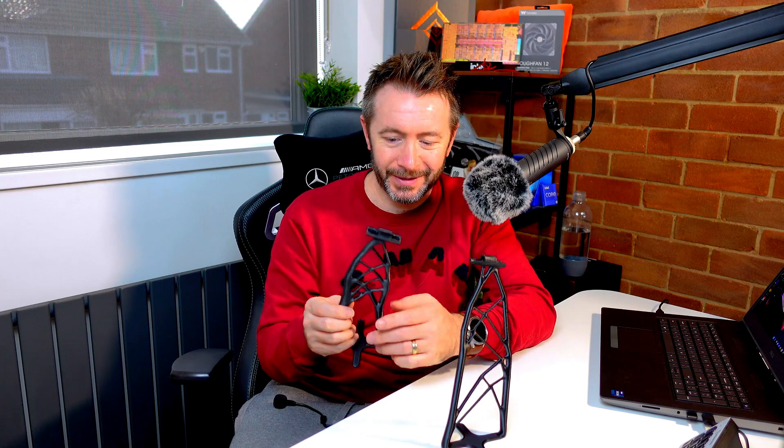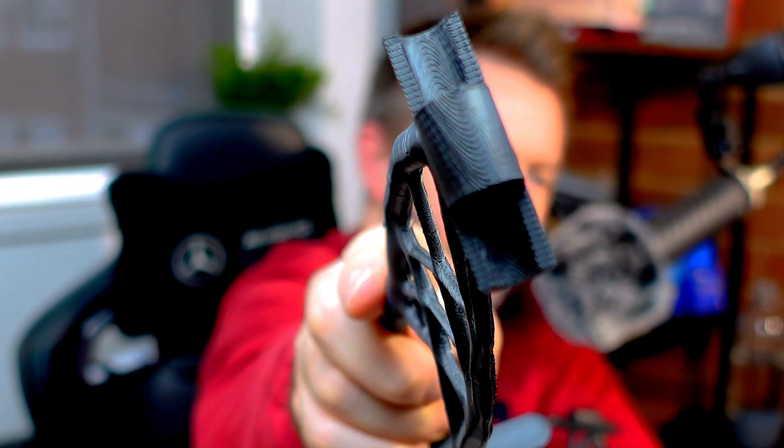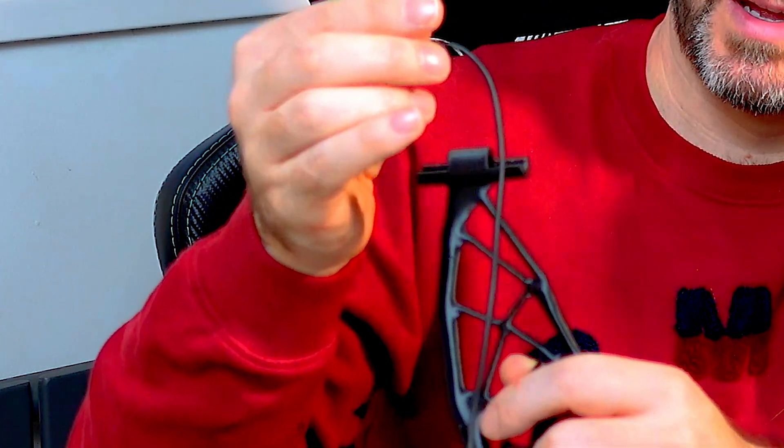This isn't one of my first attempts. One of my first attempts — I was like, oh, it's a crack. Wall thickness needs to be increased. At the top — there you go — that's where the mod mic sort of slips in and then rests in that groove. Funny thing is though, I can't get it in because there's no slit for the cable to go into. I thought, oh well done Neil. I could have just got the multi-tool out and ground a slot into it, but I thought nope, I'm having too much fun here. I'll open up Fusion 360 again, start a new study, and then that's when I ended up with just a very basic extrusion there for the cable — sliding in, and then the mic goes in like that. It's perfect tolerance.